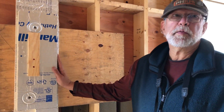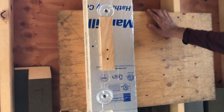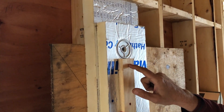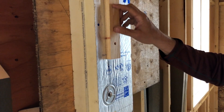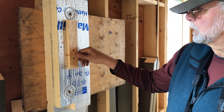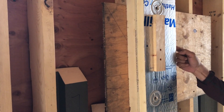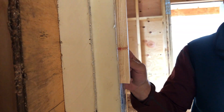This is the mockup that we made of what the exterior wall is. This is our exterior sheathing — just regular half-inch plywood on the framing. We basically built this just to see if we were going to split the furring strips. We got a two-inch layer of poly-iso, foil-faced, then a one-and-a-half-inch layer of poly-iso, and a three-quarter-inch furring strip.